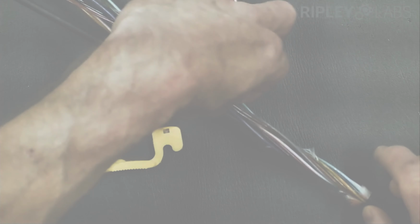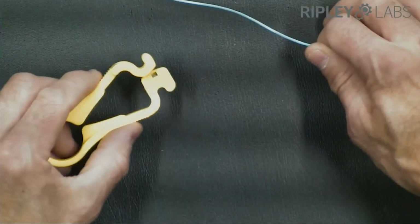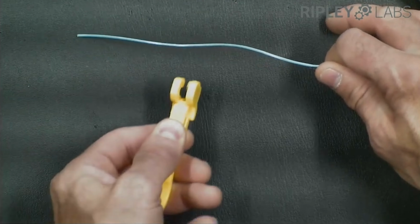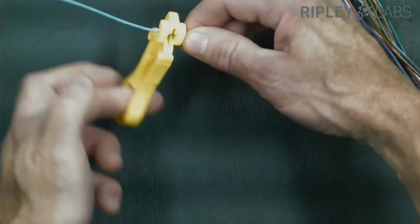We designed the Miller FTS to be simple and easy to use, allowing quick access into loose buffer tubes up to 6 mm in diameter. Simply press the tool halves together to expose the end opening. You can either slide the tool over the end or go directly over the top of your cable to your desired strip point. Rotate the tool 2 to 4 times.